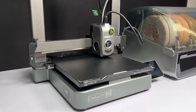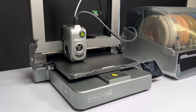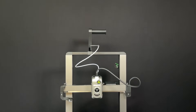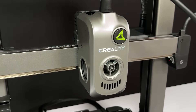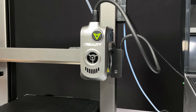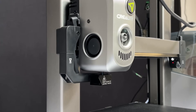The 0.4 mm nozzle is made of hardened steel and can reach up to 300 degrees Celsius, which is enough to print materials like Hyper PLA, PETG, ABS, carbon fiber, and TPU. The bed can heat up to 100 degrees Celsius. The extruder head contains dual cooling fans to cool down freshly printed layers. On the other side, it has a filament cutter and purge wiper — these are parts of the automatic system used to load and unload filament.